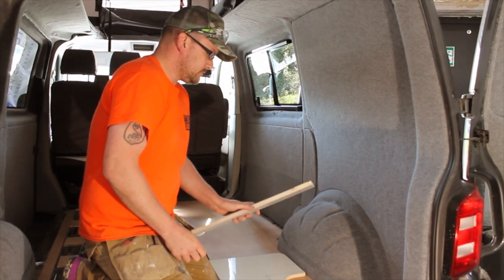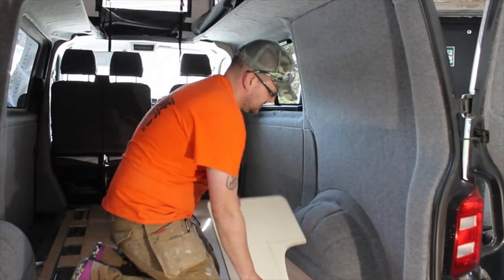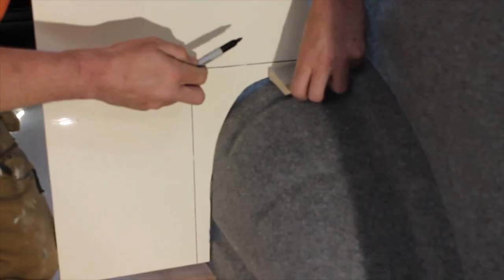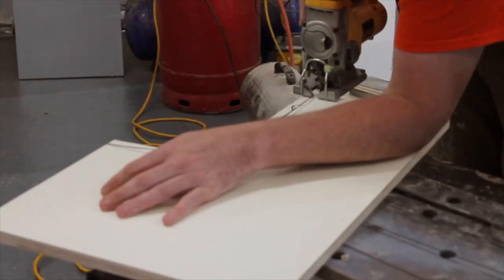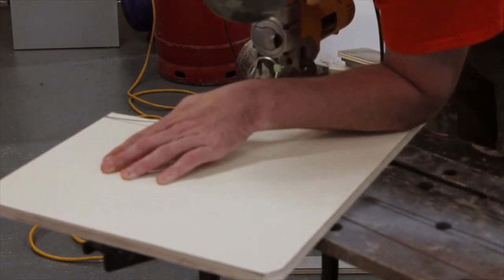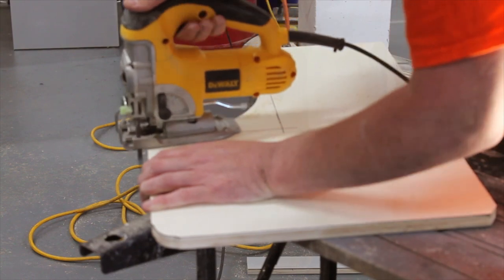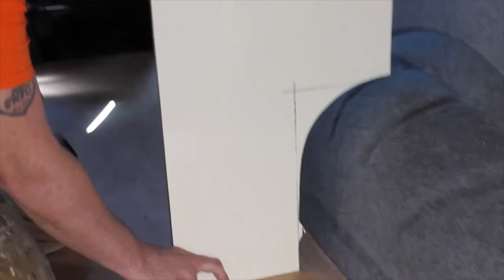For the largest gap — in this case on the corner of the wheel arch — get a small block of wood and use that as a rest for your pen. If it's a big piece, get someone to help hold it. Rest your pen on the block and draw around, which projects the shape you're leaning against onto the wood. Cut that out and once this shape is perfect, transfer the template onto your actual piece of wood by leveling the bottom and side, and the final piece should just fit.